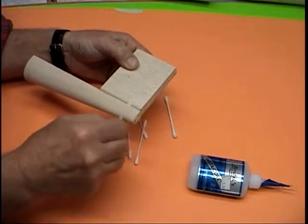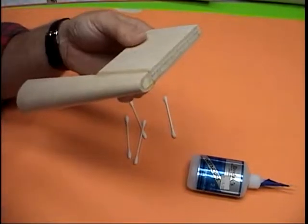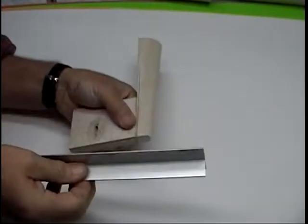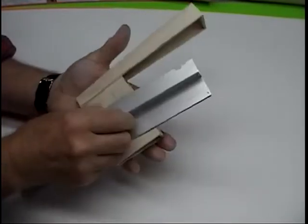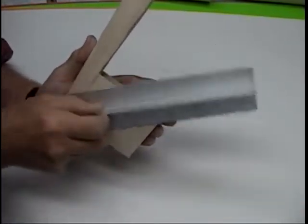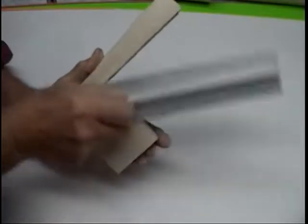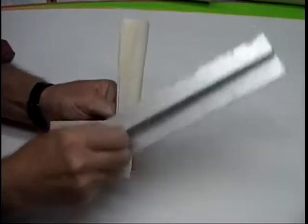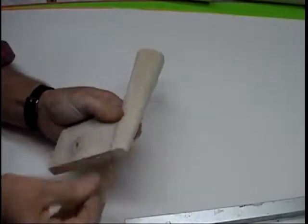Now just as an example of one of the things we have to fine tune, and there's always little things to fine tune, this came out just a little bit wide, a little bit longer. Now this back piece needed a little truing up, and as I go along, I try to true up constantly. Anytime I see something that's a 64th out, this surface here, they're always out a couple of swipes of the sandpaper. But the more I can get it done before it's all put together, and then we'll have that final sand out. Getting everything trued up now is just a little bit of an advantage. And the beauty of a take-apart plane is these parts are in your hand, they're not awkward to sand. Especially when it comes to the finishing part of this.